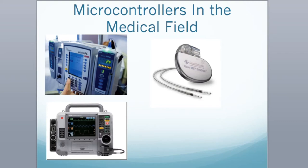On the top left is an infusion pump — it regulates the amount of drugs delivered to a patient in the ICU. It's important to regulate it consistently because too much means overdosage and too little isn't enough. You need a microcontroller to constantly sense the data and adjust the output. Pacemakers are implantable devices that sense heart activity and pace the heart back to normal rhythm. There are also multi-parameter devices used in ambulances for 12-lead EKG, pulse oximetry, and blood pressure — sensing is a big deal and microcontrollers are the way to do it.